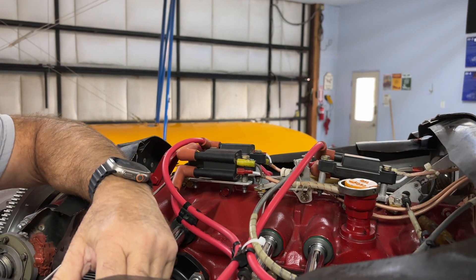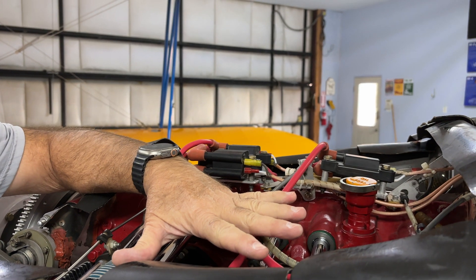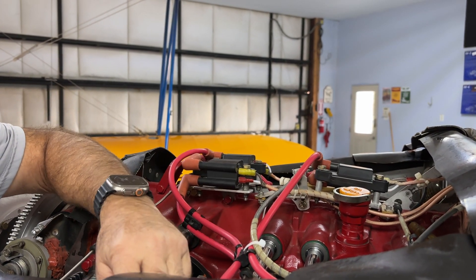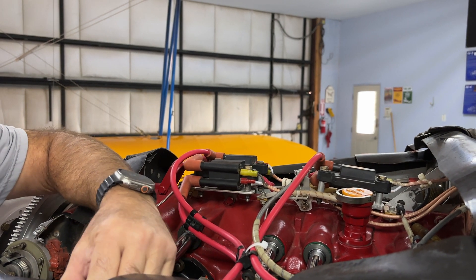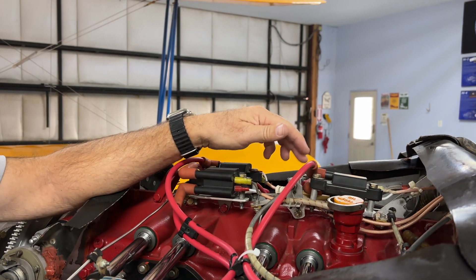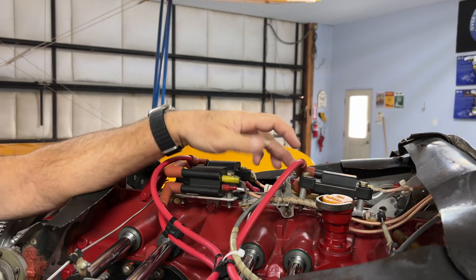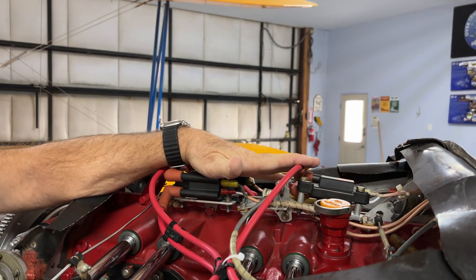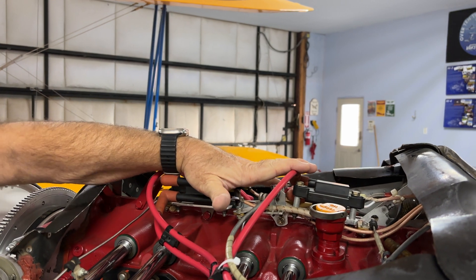It really makes sense to stay on top of the wires. With the Lightspeed system, the Denso plugs are recommended — they've got a 5k ohm resistance in them which helps. When you're replacing the wire, there is a maximum amount of resistance per foot specified in the manual, so you want to pay attention to what kind of wire you replace it with.